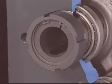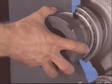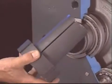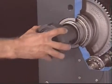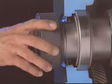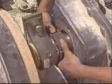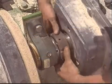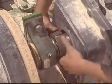The heart of Falk's new Quadrive shaft mounting system is Falk's unique TA taper. All ductile iron and center relieved, the Falk TA torque assist taper is fitted to the unit output side. When the threaded bushing nut, secured to the taper with a snap ring, is turned, it smoothly and evenly draws the bushing taper into the hollow shaft bore. When the nut is tightened, the TA taper provides a wobble-free shaft lock, even on worn shafting.